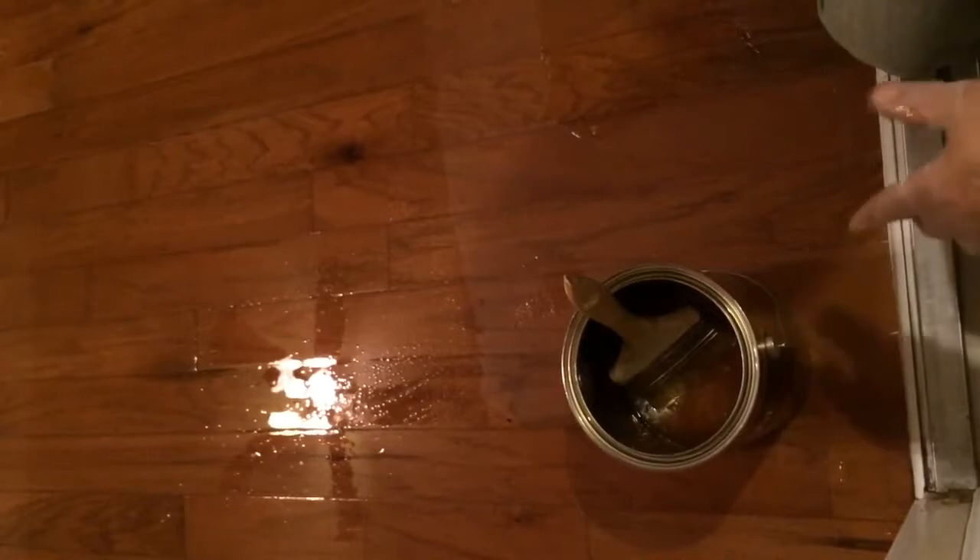Once you get to the end, this is how easy cleanup can be. You just take that lamb's wool applicator off and drop it down into the container with the polyurethane. The reason why we use that short brush is that it goes right down in there too — make sure it's submerged in the polyurethane. Seal your can up. Then the next day, if you have a few spots that you need to clean up, that's another reason why you want to have gloves on hand, so you can fish it out and touch those spots up without getting poly all over your hands.